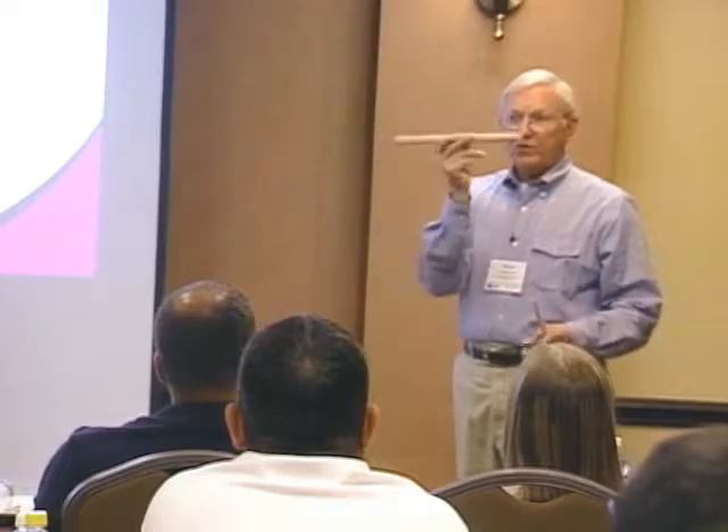The other type of fastener introduced about 105 years ago was a wire hook. Wire hooks today are not made the same way or from the same metal as 100 years ago. An advantage of a wire hook is a nice staggered pattern. A disadvantage is it requires tooling to install — sometimes several thousand dollars versus a simple hammer. There is more precision with a wire hook. This is a carded style hook, meaning each hook is individual, which gives nice troughability.